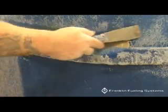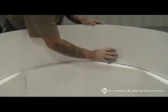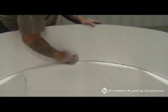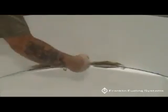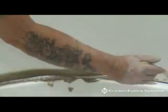With the exterior seam completed, move to the inside seam to prepare the inside surface for the putty to be applied there as well. Using a medium to rough sandpaper, scuff up the inside of the sump removing the shiny surface of the gel coat area. Once completed, use a tacky rag to remove any dust particles from the area. Then, using a paint brush, paint on the putty into the crease of the inside seam. Make sure to push putty into the seam to completely seal the area, and ensure it is a smooth area so that when the mat material is applied, it will adhere properly.